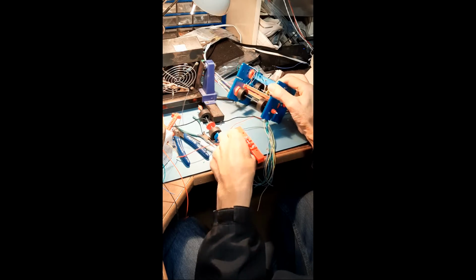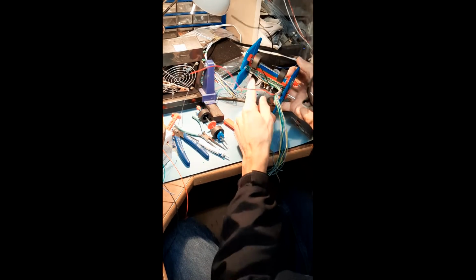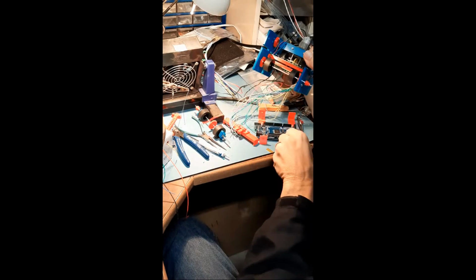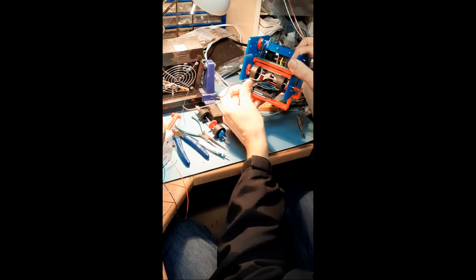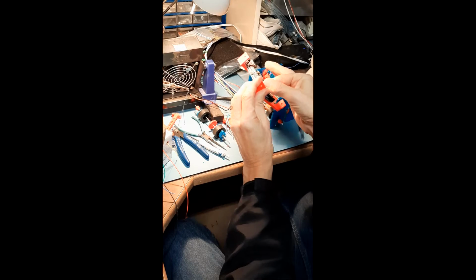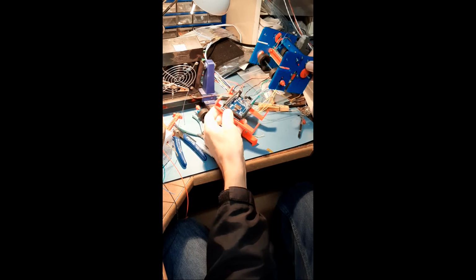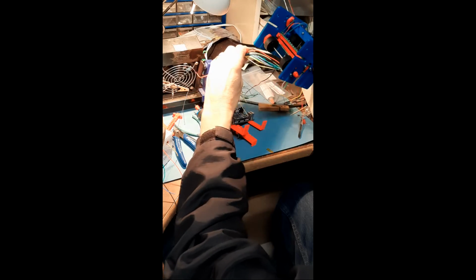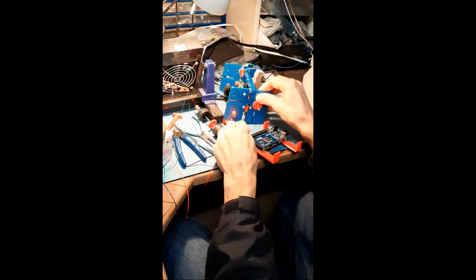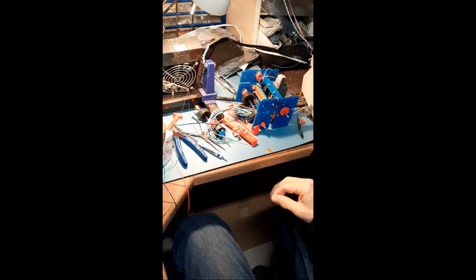The other end of it, the bulk of the wiring, are the other 12 sensors that are down here on these wires. These will come around in this fashion to attach to the Arduino, which will be lying beneath it down here, up a little bit farther. And attach to these points here, I've got a connector into the analog and power lines there, so that'll be the connector on that end of it. By looping it back over this way, it gives me, first of all, enough room to work with it, and secondly, the ability to detach this and pull it outside this way if I need better access. So that's the hope and that's the challenge, and let's see how we do.